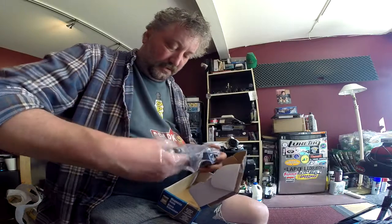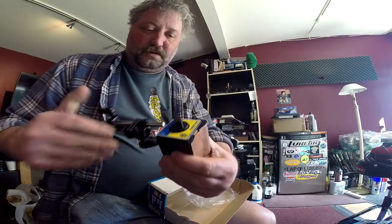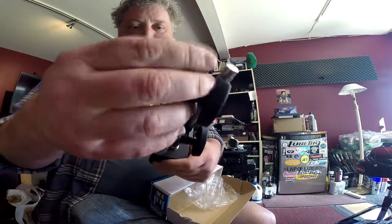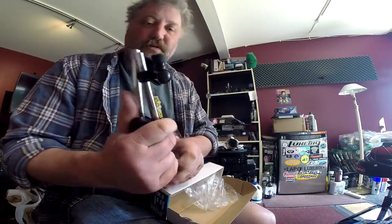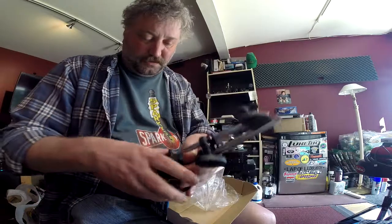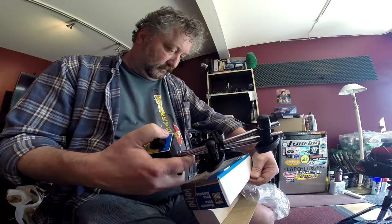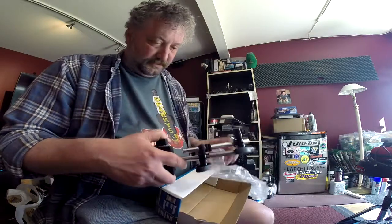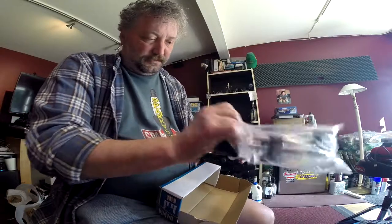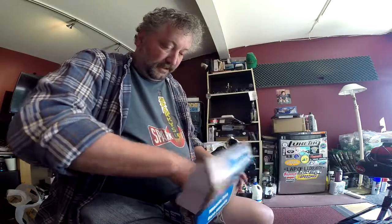I've never owned one of these — I've always been intrigued by them. There's an on/off switch for the magnet. You can just tighten all the stuff down. I'll fabricate some kind of camera mount that'll be compatible with this — that'll be pretty neat. Nice and hefty. It's 130 pounds on the magnets — more than enough for a camera or dial indicator. But you definitely, once you set this, you don't want it going walking because it'll mess up every single measurement you take.